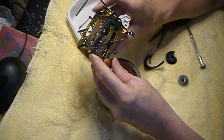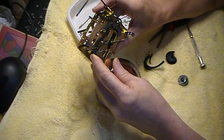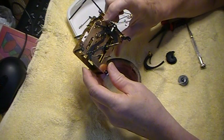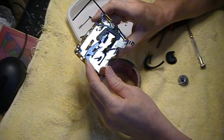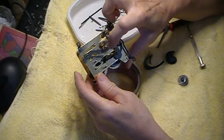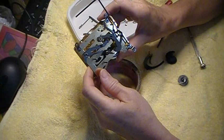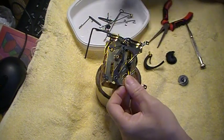Lock levers, finally, there it goes, lifts, rack stop lever. Then when it drops down, it lets the pin turn and it turns from there to there, so it's pretty quick. But the pin is catching in both places where it's supposed to, on this arm and on this arm. So lift goes into warning, drops, lets it turn the rest of the way. So we're ready to put this other cam on.